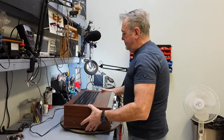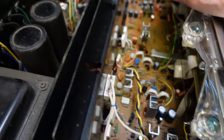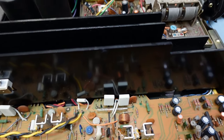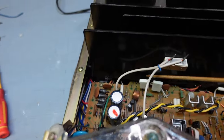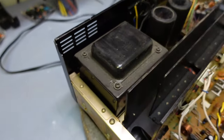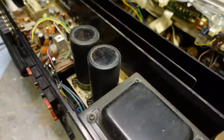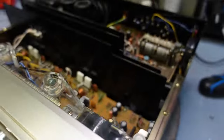We're ready to open this up. There you have it — it's beautiful. The inside looks quite clean. My output transistors are underneath this board. My emitter resistors are right here. Check out the transformer — it's huge. You know you're pushing wattage when you have a great big transformer like this. There's my filter caps, and the great big heat sink on this. All in all, it's going to be a really nice project and we'd better get to work.